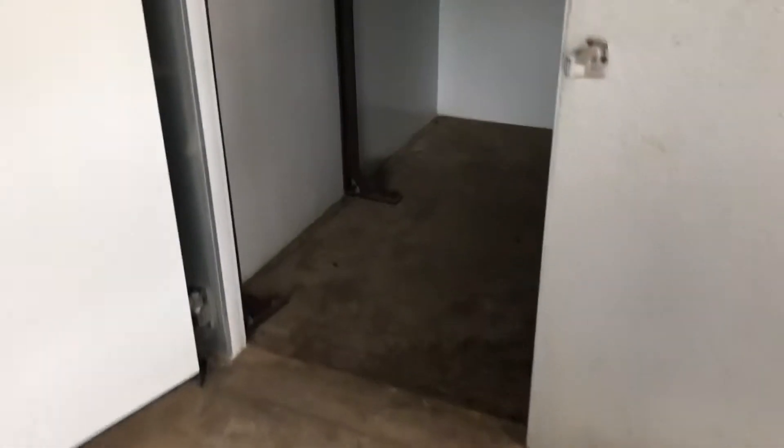I'm guessing we have a drain right there. And here's the cooler — it's about 34 to 35 inches wide at the opening, so we'll be able to get the grinder in there. We're going to go around the brackets, probably use a hand grinder around those, but on the main floor we'll be able to get the push floor grinder in. There's some pitting there that's all going to have to be filled. Really it's just foot traffic — no vehicles or pallet jacks. We've got the wide opening, wider than 30 inches, to get the floor grinder in there.